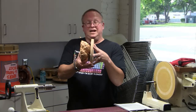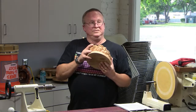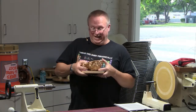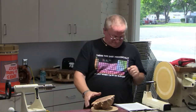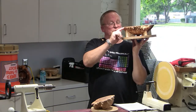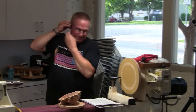And one reason for having this the same size, there's a couple of reasons. When it's spinning, this is a constant reminder of where the outer edge of the burl is. You don't want your finger, back of your hand, your wrist, to discover accidentally where this is while it's spinning. These edges tend to get very sharp, especially once you true up the face, and they will cut skin. Why do I know that? But also, we'll be doing this by gluing in wedges. And if the board is the same size as the burl, you can get out very close to the edge. Notice I'm not going all the way to the edge, and I'll explain that later. This is not going to stay on that ear.